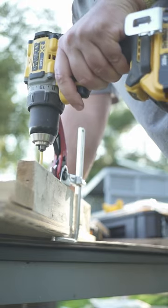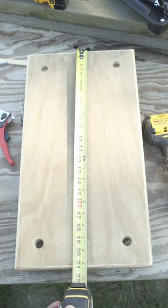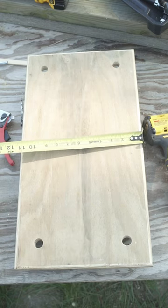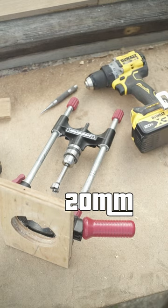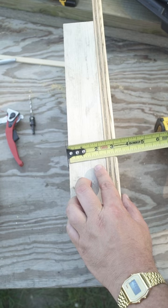Something small and versatile, maybe? We got an easy fix for that. We take some three-quarter inch scrap wood and add four 20 mil holes for that particular bench dog clamp. A 20 mil Forstner bit with the Milescraft drill mate did the job for us. Just ensure you got enough room to fasten the clamp without pinching your fingers.